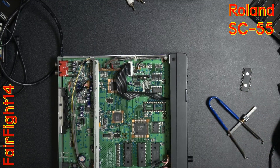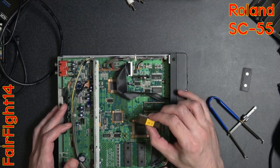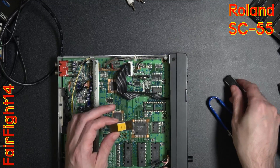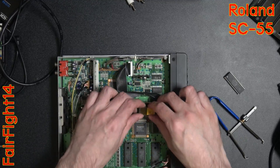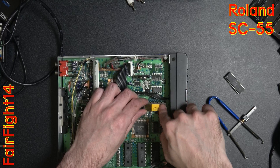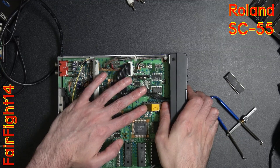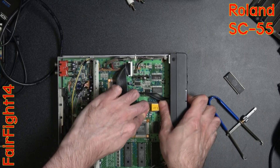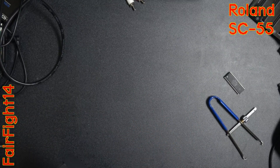For those who don't know: when replacing a chip, you must make sure the notch or little dot on the new chip aligns with the notch on the chip socket. I'm lining that up now and getting all the legs in the right places. The chip to use for programming is an EEPROM — specifically a 27C020 or 27C2001; I'm using the 27C2001. I double-checked both sides for any bent legs and it looks fine.